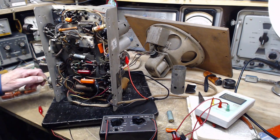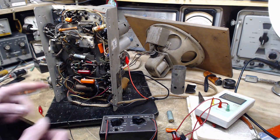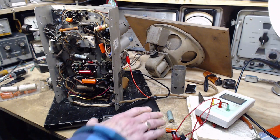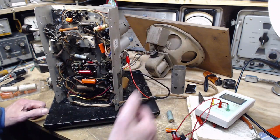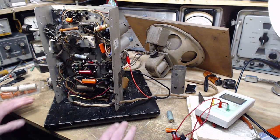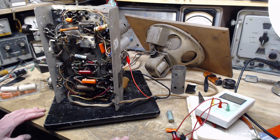My impression is that absolutely nothing changed in the radio's operation, put that capacitor in or take it out. So for now, I'm going to leave it out, since it doesn't seem to be having any benefit to putting it in. And the radio's operating. Maybe it's not supposed to be in. Maybe that schematic's not right. Maybe it has a relationship to the changed tube, the alternate tube that's up here, and that doesn't match the schematic. I kind of doubt that. Okay, so that's settled. I'll just keep it in mind, but I won't worry about it now.